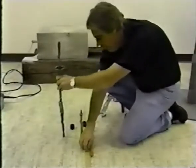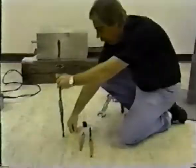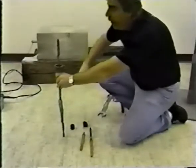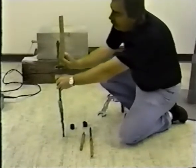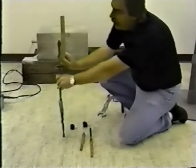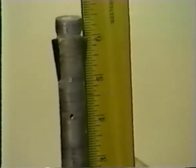The depth at which the undercut is formed in the concrete is controlled by the position of the bearing sleeve. This sleeve should be set to a length equal to the minimum embedment depth. This is checked by measuring the distance between the bottom of the bearing sleeve to the top of the fully extended undercut blades.